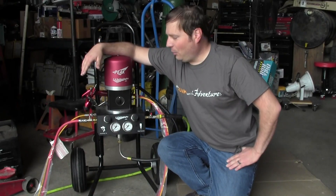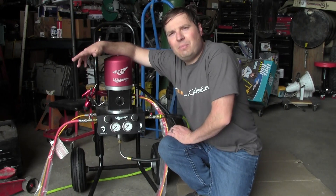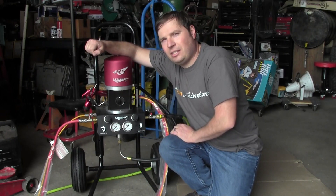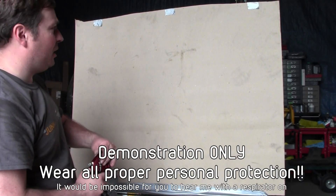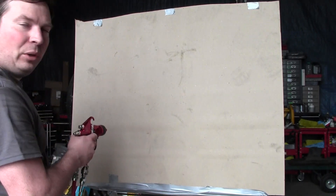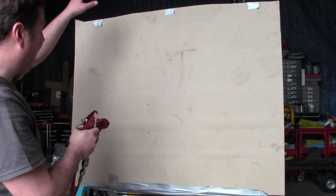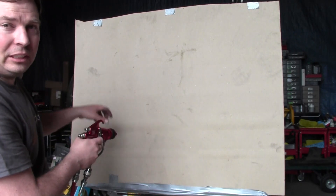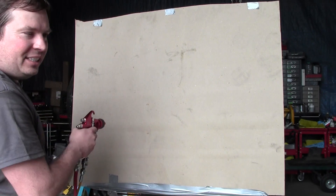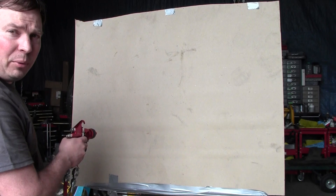We're in the other shop and we're going to shoot some actual paint. I'll show you how to set your pressures, check a pattern, and then we'll spray some metal lawn chairs to demonstrate the finish quality, minimal overspray, and coverage you can get. I have a piece of cardboard up — you can use butcher paper, anything — but always do a spray-out test first. I have only the fluid pressure regulator on with no atomizing air yet, just to check the pattern. Reading the paint data, I need around 600 to 700 psi for an air assist airless, so I need about 40 pounds of input pressure.